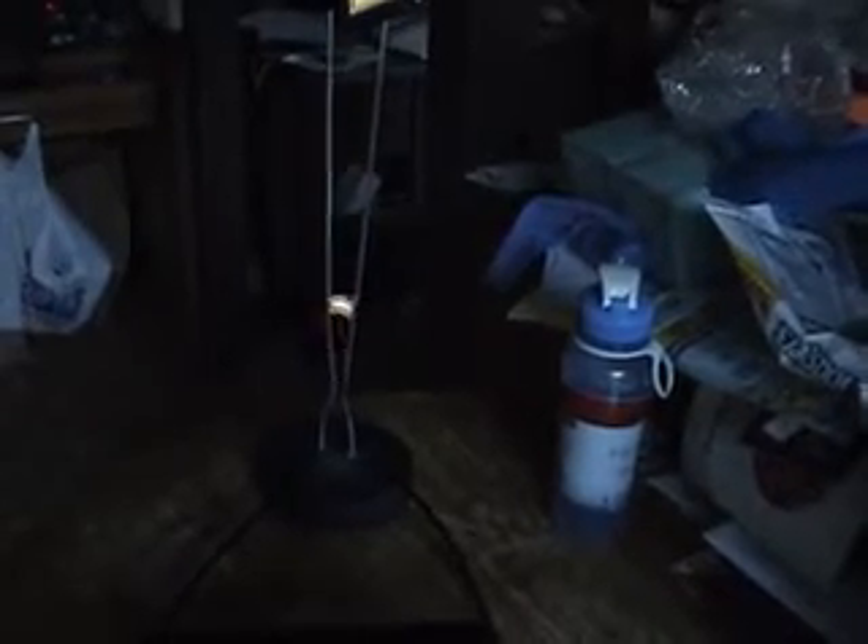It's just on a high-density particle board base, hammered in like nails. What's making it go wacky now as opposed to what it was doing earlier is very slight movements in the air causing the arc to bend out behind what you can see, which increases the gap. You can see here how it bends out and then makes it stop earlier than it normally would.